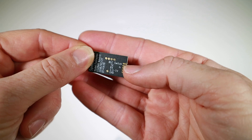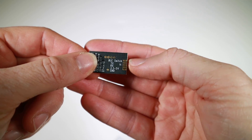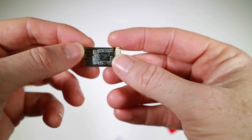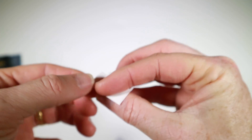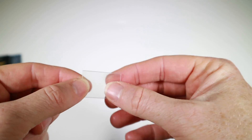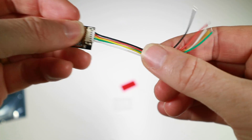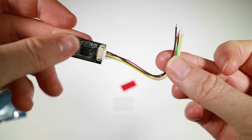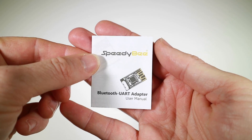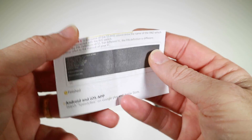It's the BLE switch that takes a little more thinking about. This is something that will enable and disable the actual Bluetooth device so you don't get any interference during flight. There's just a sticky pad for sticking it on, a bit of heat shrink cable, end plugs, and you can solder these directly in or make up a little adapter. And finally there's a little user manual, which is actually pretty good.